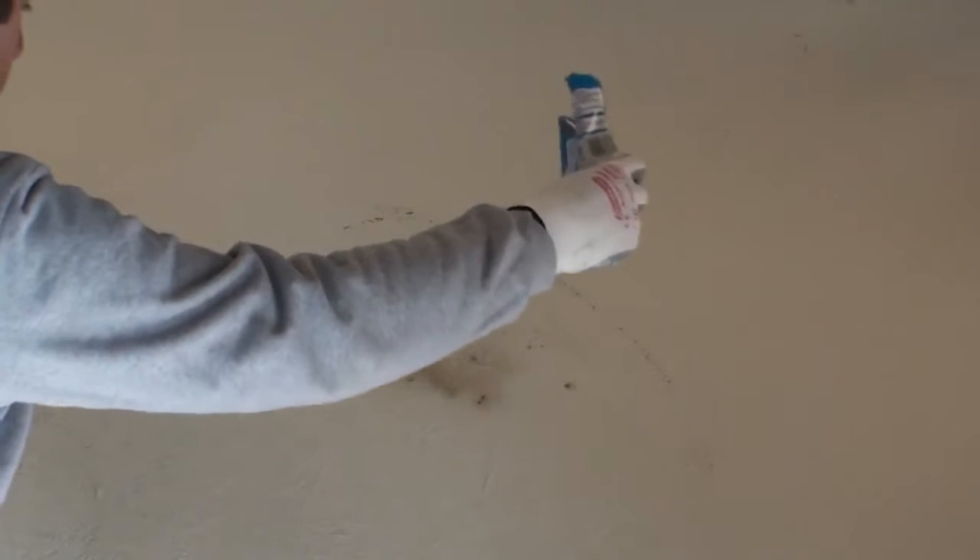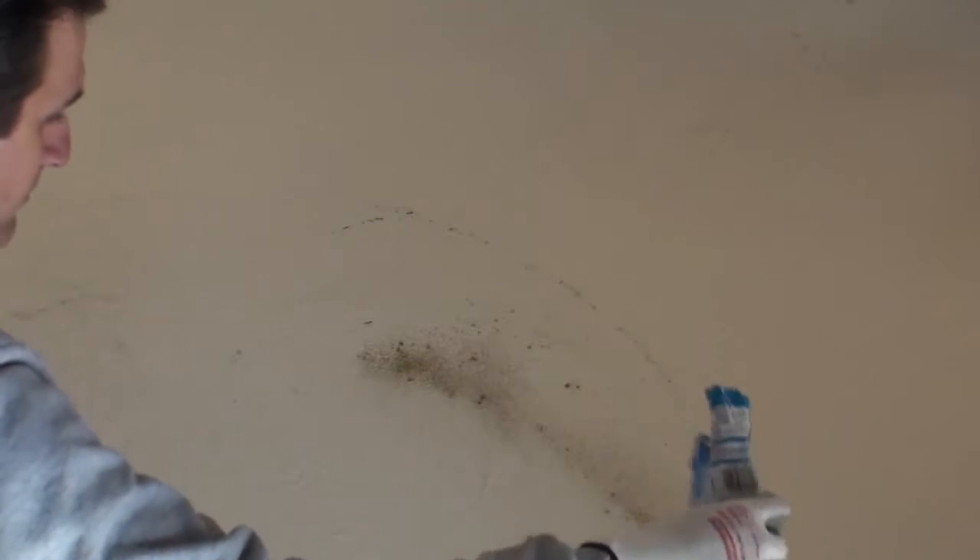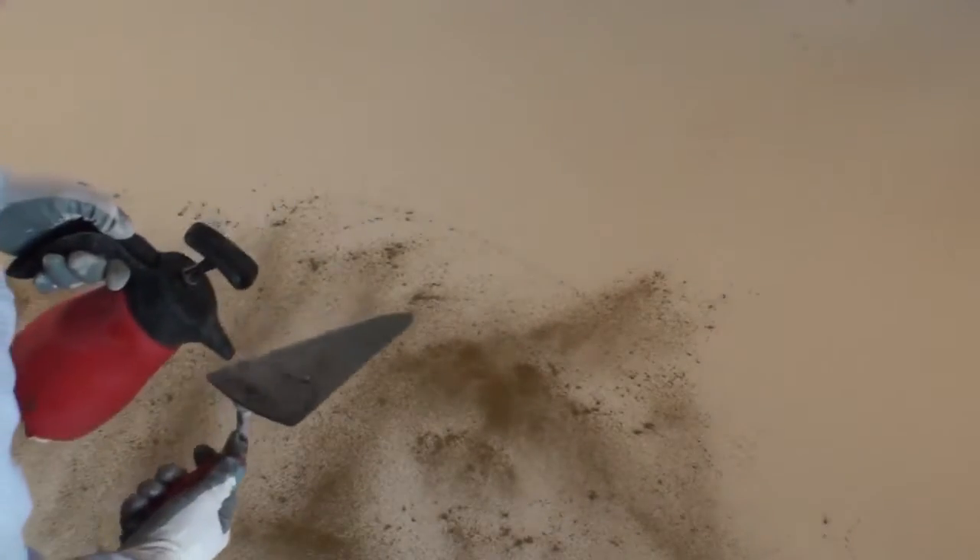After flattening is complete, prepare yourself for treating the surface in a highly decorative mood. Spread over the surface with powder pigment Durocolor Powder C in Swatch Hue 32, named Cinnamon. Wet the trowel on the side to contact the cement mortar and produce waves of the dark tone inside the white backdrop.